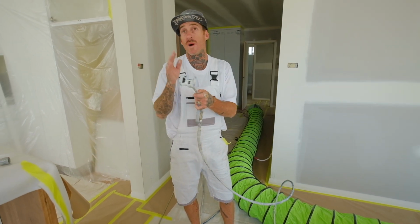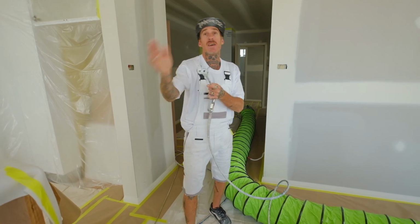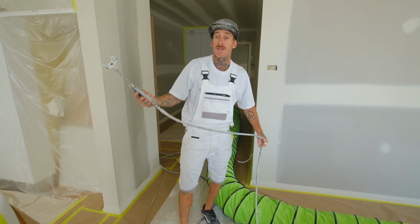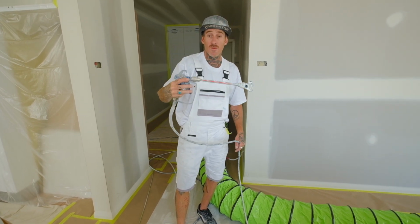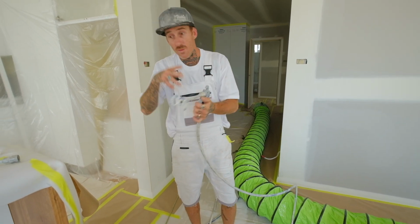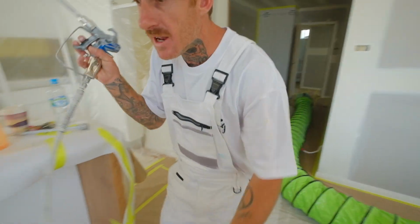There's no way I can always walk into a job and go, hey, I'm spraying Acro enamel at 1100 PSI, and that's what I run it at every day, because it just doesn't work like that. So I always pretty much run it through the paint. I always tell my pressure, whatever it is, by fine tuning my fan.